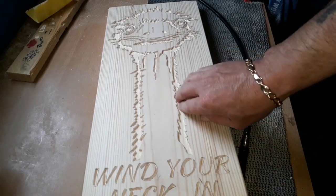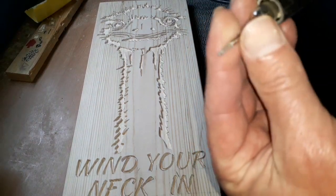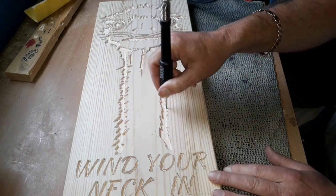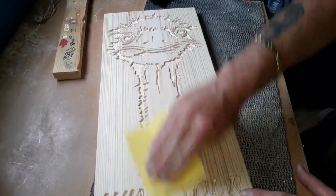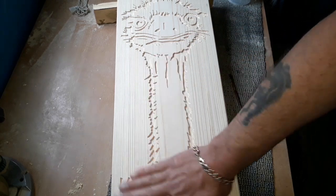We've took all our inner bits out with our carbide end mill engraving bit — that's a mouthful. We've had no disasters; everything's still in one piece and we haven't lost any little bits. All I like to do now, and this is just a personal preference, is literally go around with a Dremel with a small engraving bit just for a quick tidy-up. Then I used a little mouse sander in the end just to smooth that down, and it's all clean now, all nice and smooth.